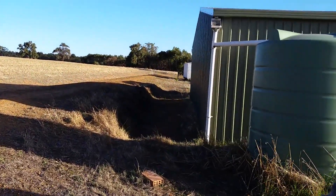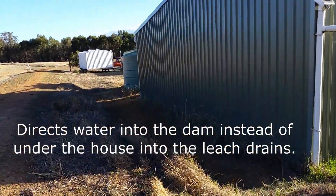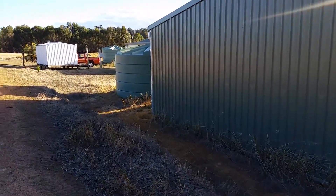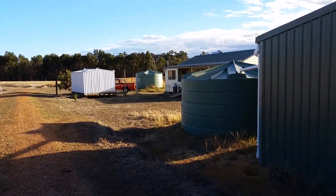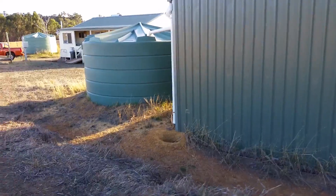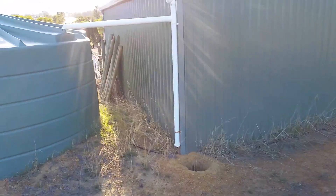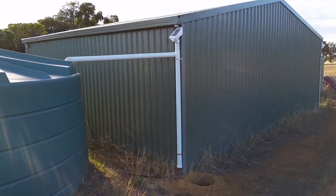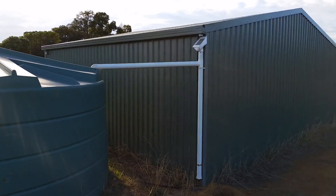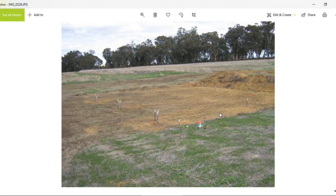This swale here became my driveway, and I made it wide enough to take the water tanks. There are three tanks: two 25,000-litre tanks and one 3,000-litre tank. All the tops are level so that you can connect the bottoms and they will all be self-leveling. The rainwater goes through a filter system, which is mosquito-proof, into the tank. I'll talk a bit more about the construction and then you'll find out why I chose stumps instead of pads.